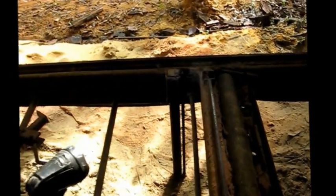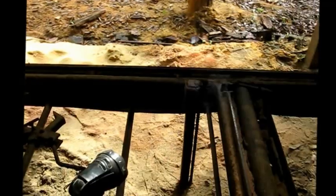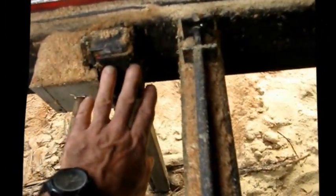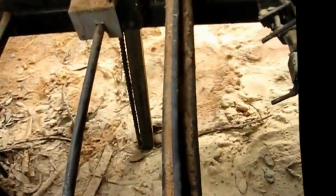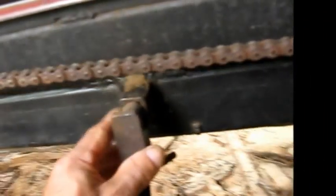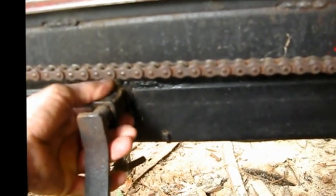Wanted to show you the fences here — the log stops. This mill had horizontal log stops where you would reach over, grab them, and lift them up. They were bolted right there and laid out this way. I took advantage of this and used inch-and-a-half quarter-wall square tubing, meshed a bar through the frame — not even using bearing but a piece of one-inch square tubing, eighth wall, and three-quarter inch round bar — and made a handle.